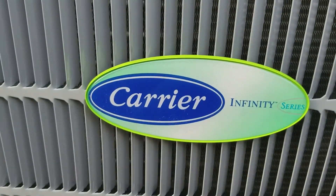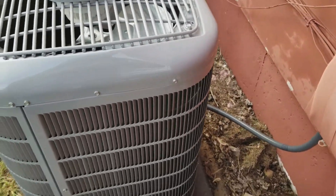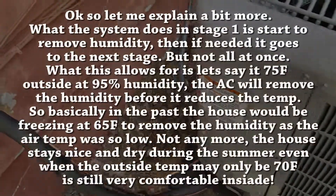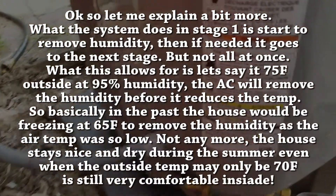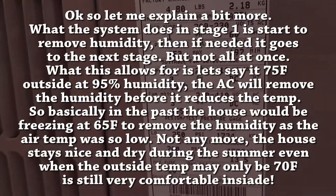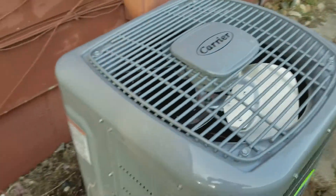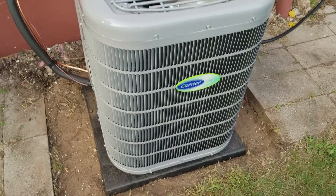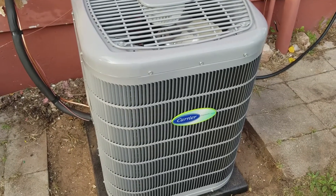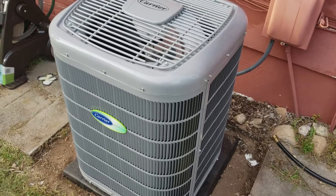This is a five-stage air conditioning unit on demand — each stage gradually increases as it calls for more demand to get the house cooler. Most of the time it's going to be running in just dehumidify mode, which will actually keep the temperature down. Before, all we had was a single stage that would just come on or off. To get humidity out of the house you'd have to make it so cold you'd need a jacket inside. This will eliminate those problems — you just set the temperature and it'll dehumidify probably on one stage, making it extremely comfortable.